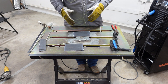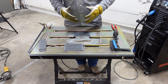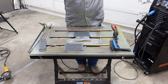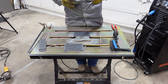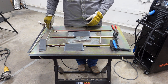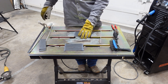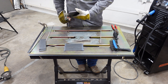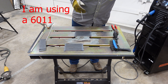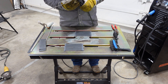Now let's get into some actual welding. The first thing you need to do is put on your PPE — that means long sleeve shirt, leather gloves, and a welding helmet. If you're curious about which welding helmet might be right for you, I've got a full video on that. Then we're going to need to ground out our welding table so we can ground to our workpiece. If you're doing this on the garage floor or outside, you can directly ground to your metal and that's not a problem either. We're going to grab our electrode and our electrode holder, connect the two, and now we're ready to weld.